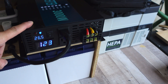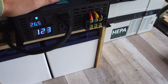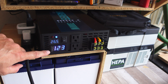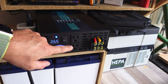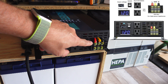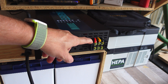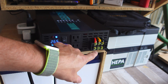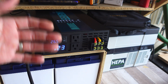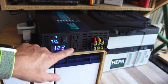As far as this inverter is concerned, so far in immediate testing it has been fabulous — I haven't even heard the fans cut on. This inverter displays your current battery voltage as well as the output voltage, and it's got two standalone 15-amp receptacles. The cool thing about this unit is it's got a hardwired terminal block that's good for up to 25 amps, so you can run something like Romex wiring into these terminals and technically run household electrics for a small cabin or shed.